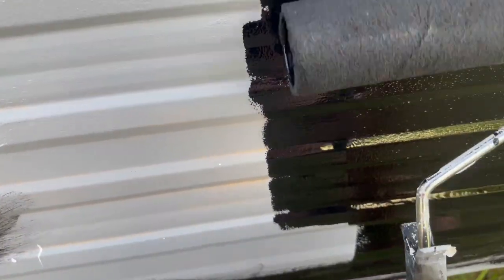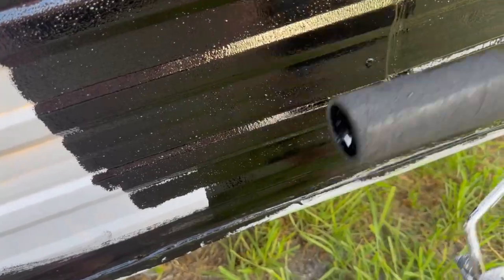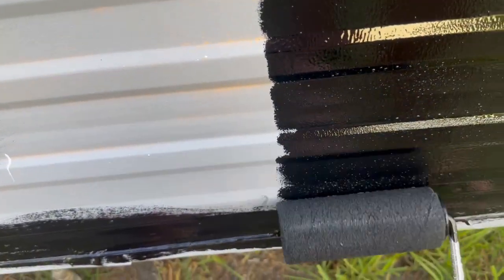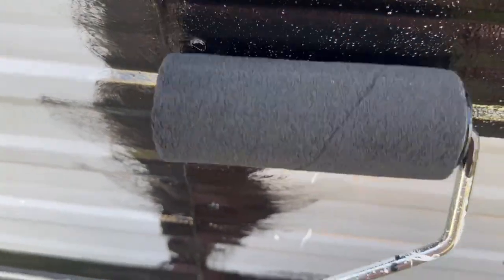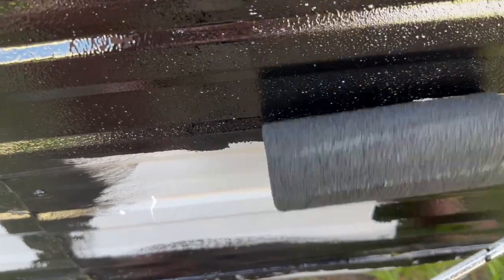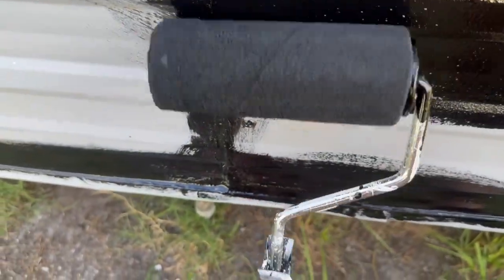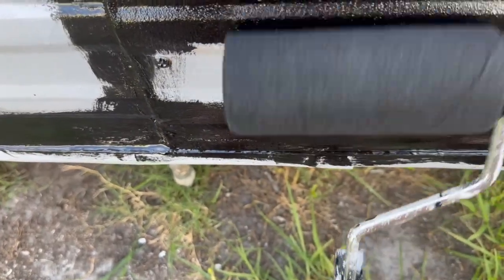Even with the roller, go back over sections you've done with the first load - when the roller is very full it can be a bit thick and create a run, not just little drips but a big run all the way across. You don't want that. So slow down is my tip - investigate your rollers, find your Goldilocks. I'm using a Dulux black and a White Knight white; they're both metal enamel paints and rust preventative. Go quite slowly and make sure it's all covered in the first instance - you don't want half coverage.